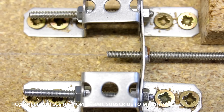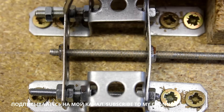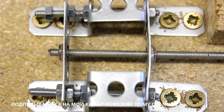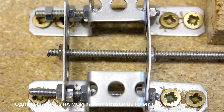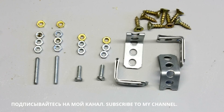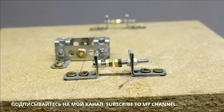As you can see, there is some clearance when using just one nut for the drive. The second metal stripe is mounted in such a way that the clearance is as low as possible. The lower the clearance, the higher the friction. The right adjustment is a compromise between friction and clearance. The axes are guided by the middle aluminum bar using perforated metal stripes as well as 3mm screws and nuts. Once again I am using press nuts at the ends of the screws to reduce abrasion of the aluminum angles. The adjustment is a compromise between low clearance and friction.